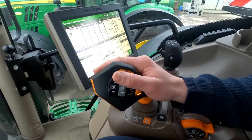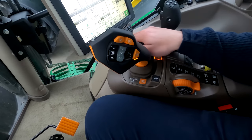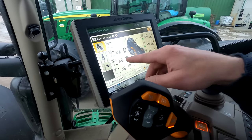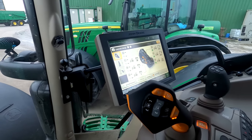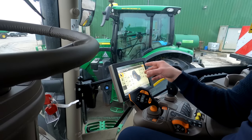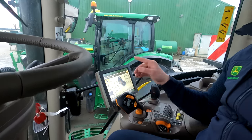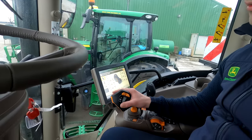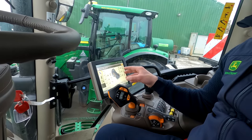Everything is sitting close to your fingers with all single actions. You can save these configurable buttons to whatever sequence you wish. So if I have a wagon on the back, I can configure the whole joystick for that implement, hit save, put in my name and the implement and leave. The next driver can click load, select their name and the wagon, and all the functions will be programmed back exactly the way they had it. You can have multiple drivers with their own saved configurations.